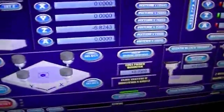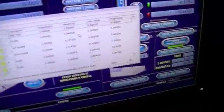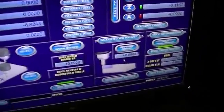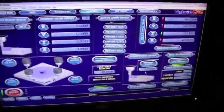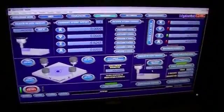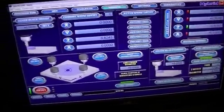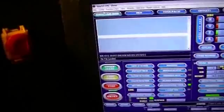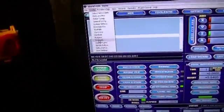And if you'll notice, up in my config, it's 5.940500, because I have 500 thousandths of an inch of backlash on Z, and I've already got that set on Z. I'm not sure if I've put together a video on that or not. As far as for YouTube, I got quite a few on my Facebook page as well. But in the next video, I'm going to go over how to set up various tools in the tool table.